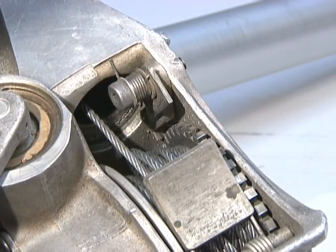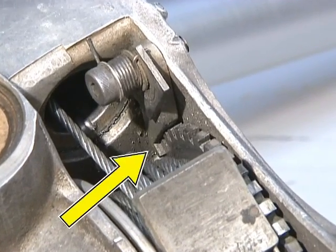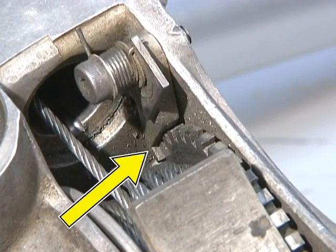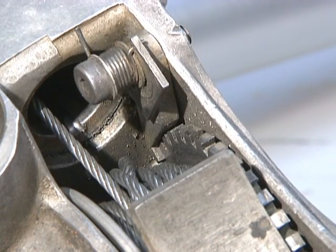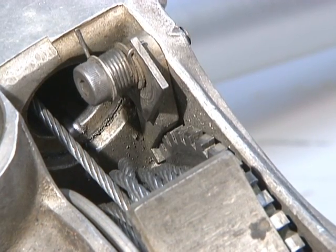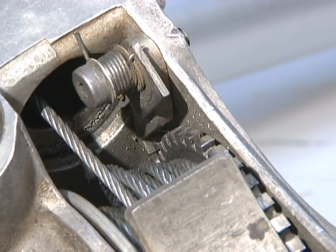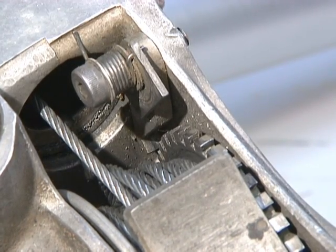If for any reason the hoist locks while in use, the overload mechanism has been engaged. Further torque to the handle at this stage will only damage the unit, usually a broken handle or damage to the ratchet flange. Reverse direction and discover the overload cause, such as interference. After correcting, resume slowly.